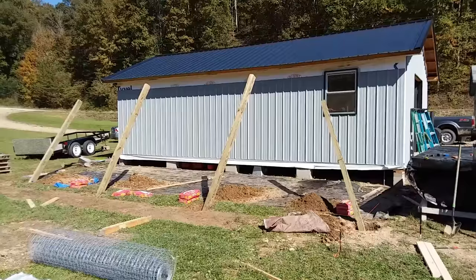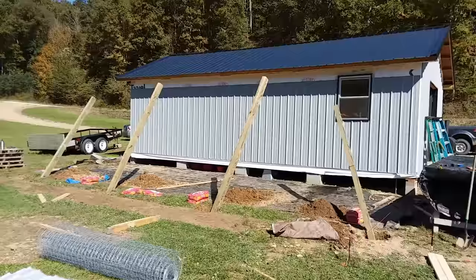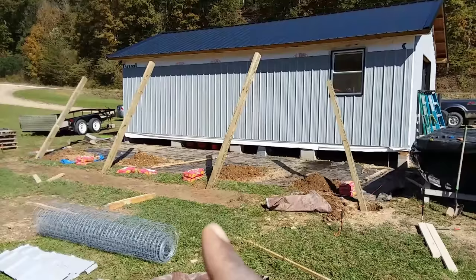We're gonna go 8 feet high on this end, so that we have a slope coming from up under where the ledger board is gonna be running all the way across, and then we're going to use 2x4s for the roof, and we'll put a little bit more weed barrier down underneath, and we'll set some pallets under there,